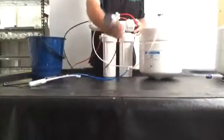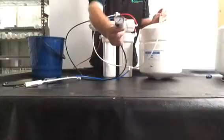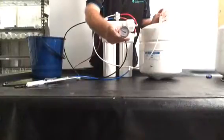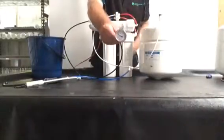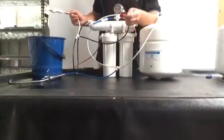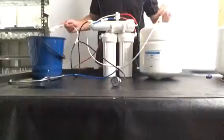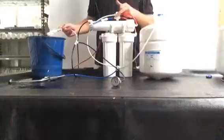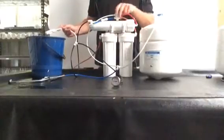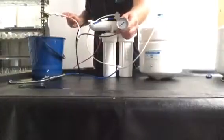The pressure gauge is sitting at zero. As soon as I open the tank, the tank will begin to fill with water — and you can see straight away the pressure gauge has gone from zero to about 50 psi. That's a very important part of the system. If your pressure is low because the filters are blocking up, the water will just keep running to drain down the black tube. As you can see, the black tube is running because the tank is filling. As soon as I turn the tank off, the automatic shutoff valve has a piston that knows not to produce water anymore. It shuts itself off, stops the water going through, and the whole process comes to a halt. You'll see the pressure gauge is at zero and the drain has stopped.